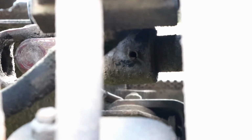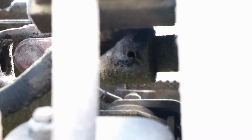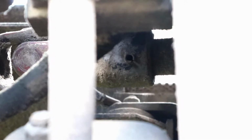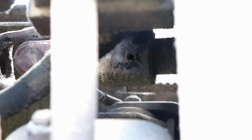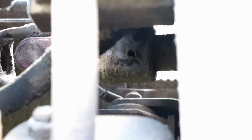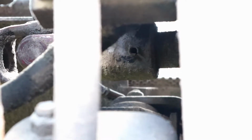So right there's the drive shaft. You're looking directly through where I just took off the side panel, and we're looking right at the roll pin. So I can stick my now longer punch that I made and heat treated right through where the side panel came off, push the roll pin out, and take the drive shaft off along with the pump.